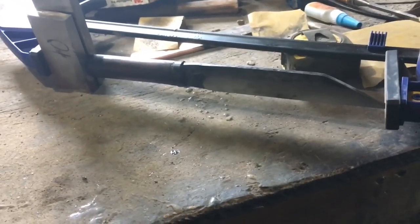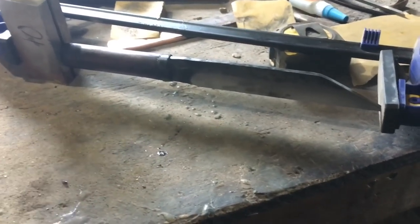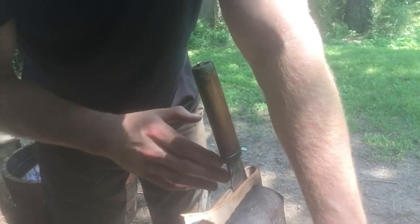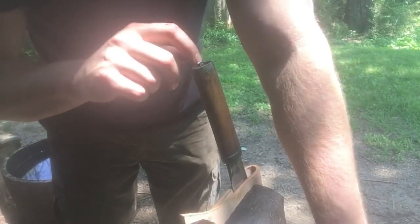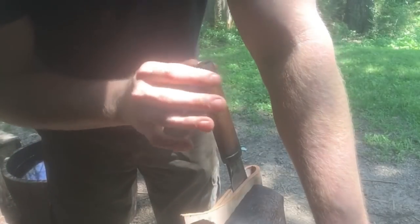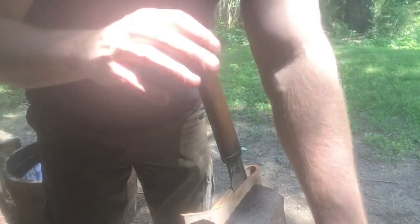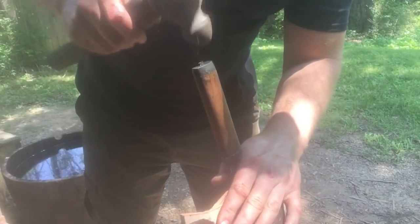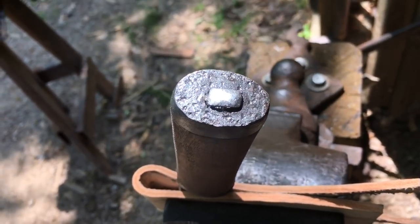All the pieces are glued up. I've stuck two pieces of scrap steel into the bar clamp because the tang of the knife is still sticking out, so I couldn't just set it against the bar clamp directly. To permanently affix everything together, I've got it clamped up in the vise with a piece of leather to keep from marring the blade, and we're going to peen over this little bit of exposed tang. Because the bolster is so thin, I'm worried about scorching the epoxy inside the handle, so I'm going to be peening it cold. Now it's all permanently affixed.